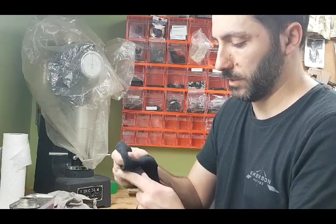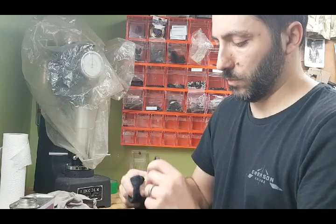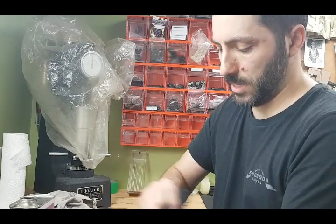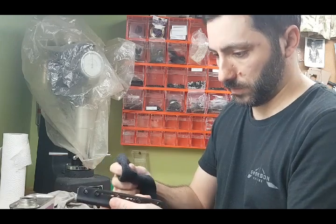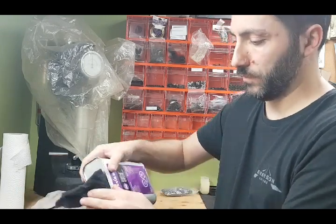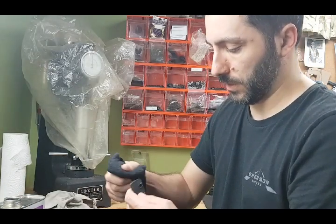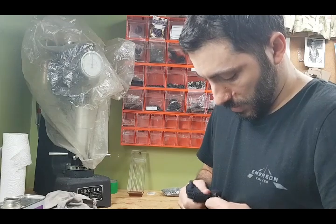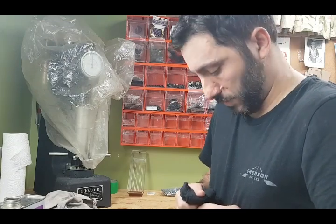What we're doing is melting the plastic — a really localized chemical melt. What it does is it evens everything out and gets rid of all those sanding marks. You can even do this on a 60-grit belt-finished edge; it'll take a little longer but it will still clean it up. Again, wear a mask when you're doing this.